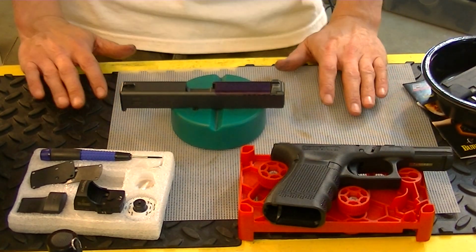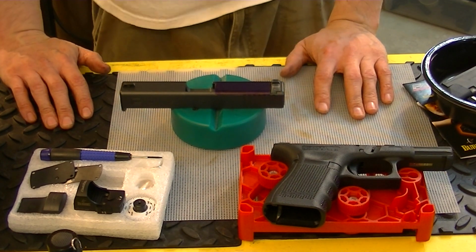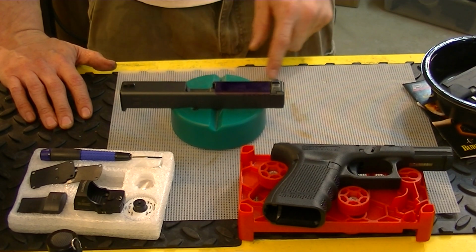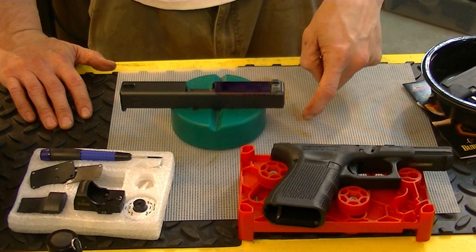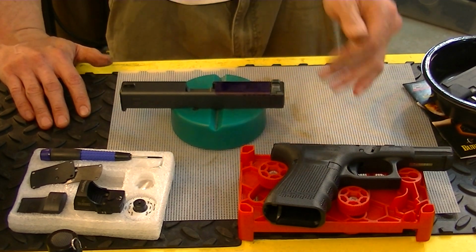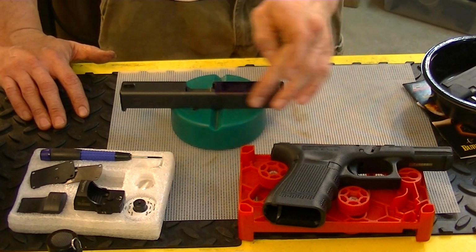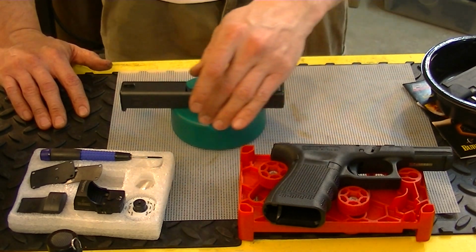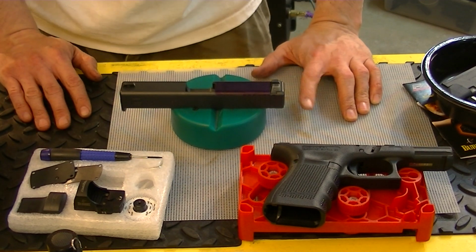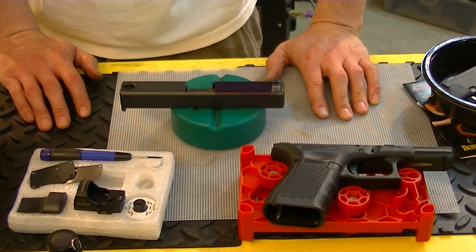Layout fluid is really good if, say, you're going to machine a piece of plate or something. You cover that with layout fluid and then you trace with a scribe. There's all different types of tooling for it. You lay out your design. And once you have laid it out and scribed what you want your design to be, the idea is you do it exactly to one-to-one scale, where it's perfect scale.